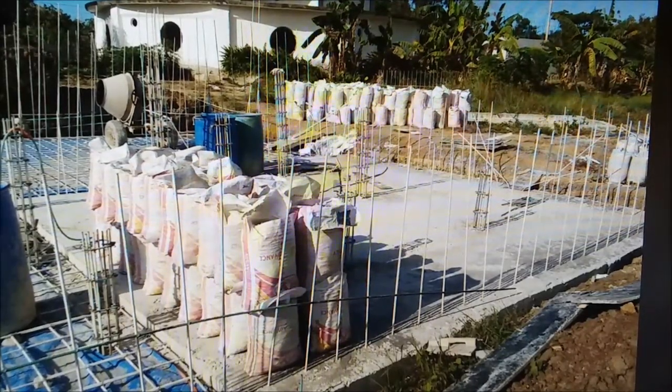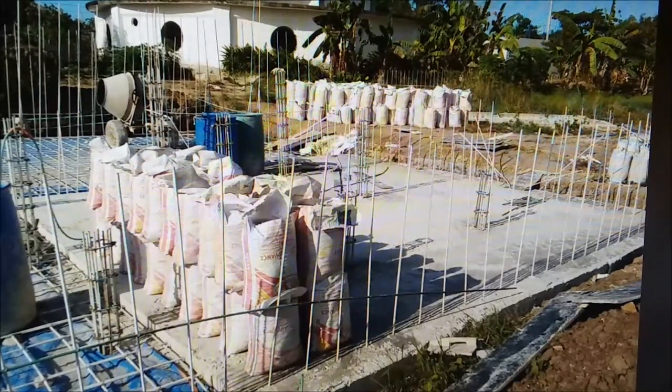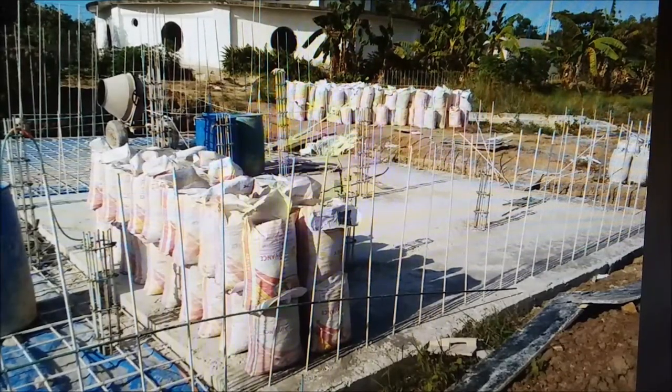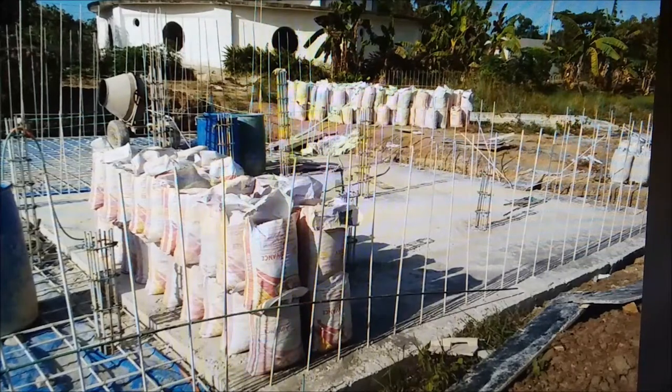That's why this house isn't hot. You have big overhangs — bigger overhangs at the top — and there's another roof up here over top of the main roof, on top of the spider beam. So the direct sun from above is all being reflected back. There's very little ceiling exposed to actual sun — on the other side there's something above all of them.